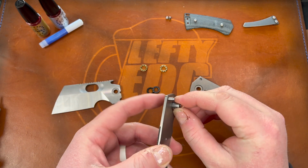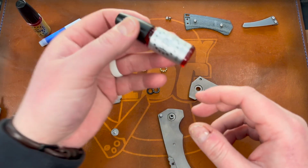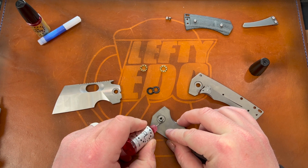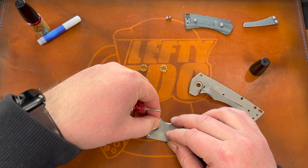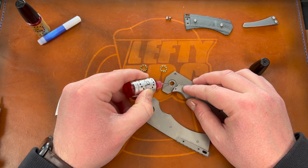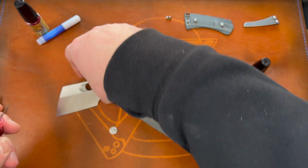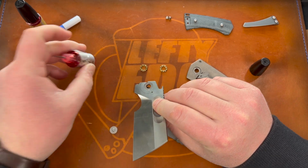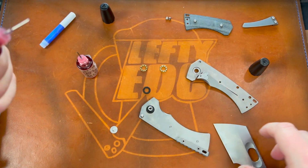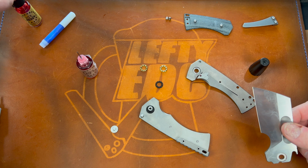All right, so pivot goes through here. You can tell because it also needs to be turned this way so the atom is appropriately aimed up. We're going to take some KPL original. Dot, dot, dot, dot. Nothing crazy, just a little bit. Make sure these fit. They do. While I'm here, dot, dot, dot, dot. Perfect. Dot, dot, dot, dot. Okay. Also going to take my KPL heavy. And I'm just going to put a drop right there on the detent ball. Bang. We should be golden.